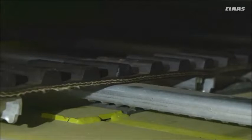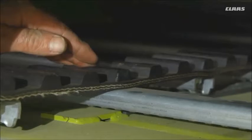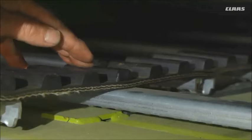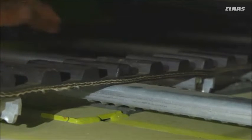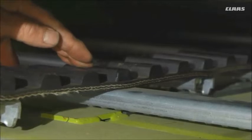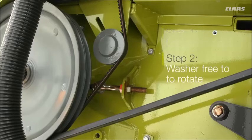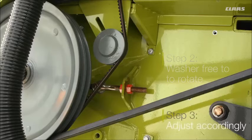With the front elevator chain or belt, to check that they are properly adjusted is when the 3rd and 4th feed slats from the front slightly touch the feeder housing bottom or the slide rails. This particular machine, the belts are a little bit loose. To adjust these, there's the adjuster on the right and the left hand side of the feeder housing. Loosen the nut and make sure the washer becomes loose and then adjust the front roller forward or backwards to increase or decrease the tension on the chain or the belt.